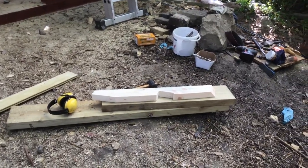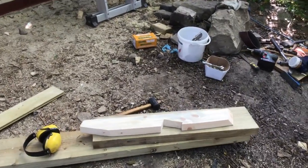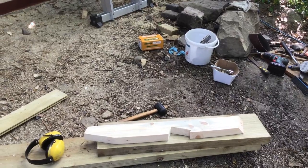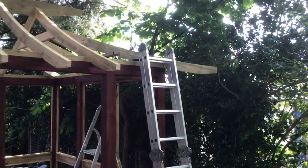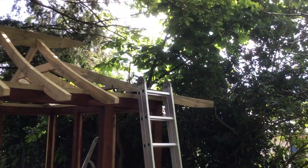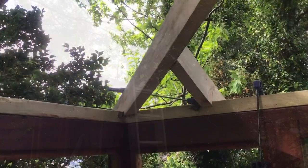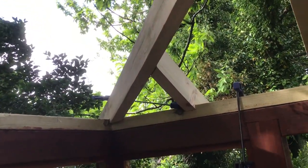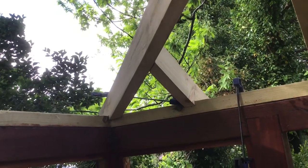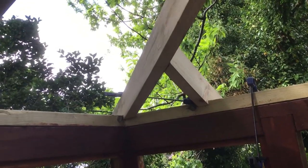There's the finished article. All that needs to be done now is to be fitted to the corner of the tea house. So what I need to do now is to mark out the angle for the side rafter — the quadrant side rafter — and cut it to shape so it can fit just there.